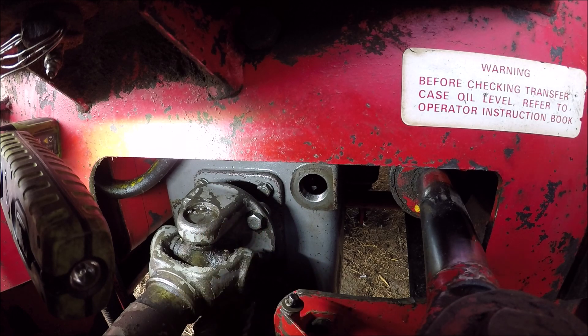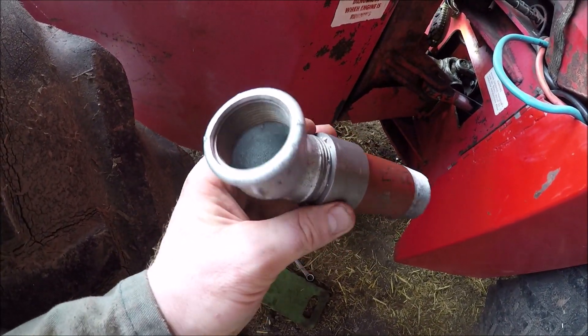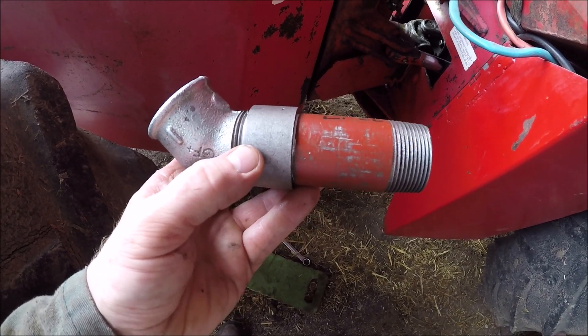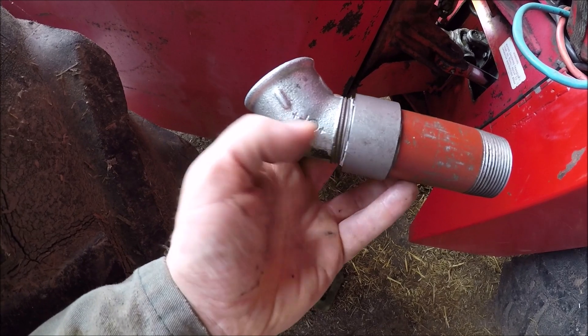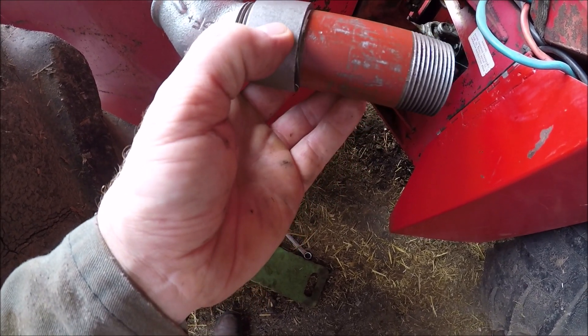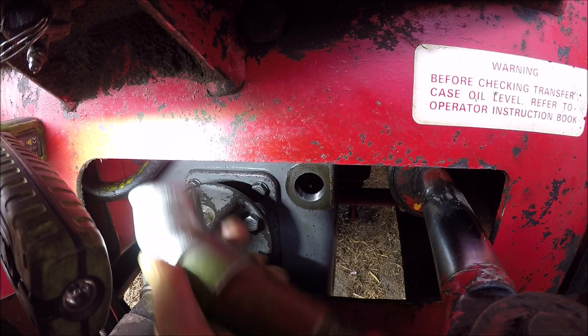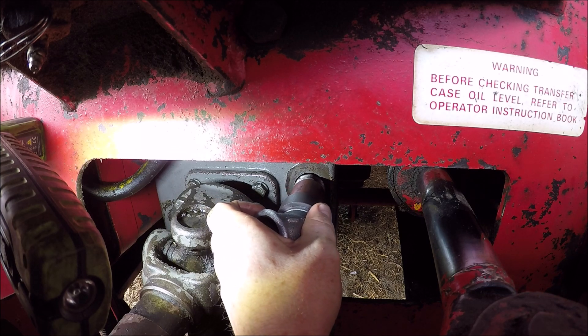What we're going to do is do away with this - we're going to bring this level plug out. So we screw the plug out and that leaves us a hole. What we're going to put in is this adapter we've made up - it's just inch and a quarter BSP standard pipe fittings with a 45-degree elbow on the end. I've had to shorten the threaded coupler quite a bit because the length is critical, otherwise you won't be able to turn it past the frame.